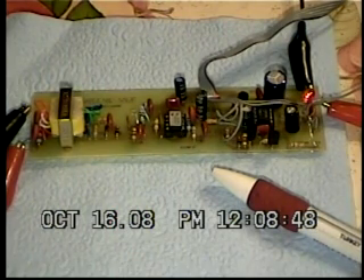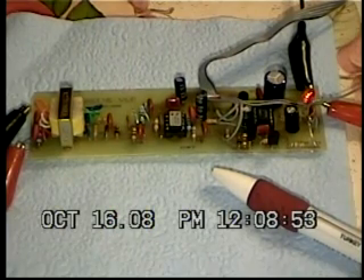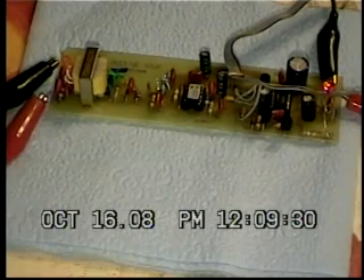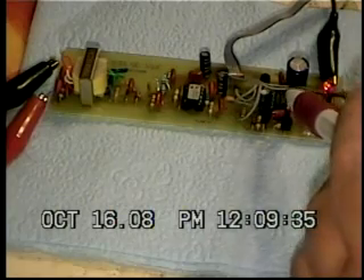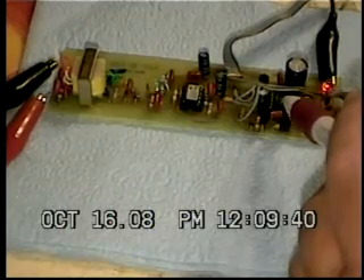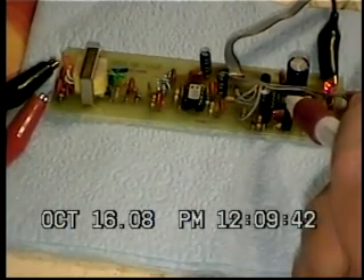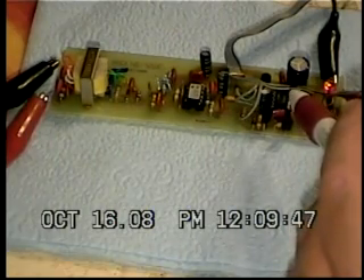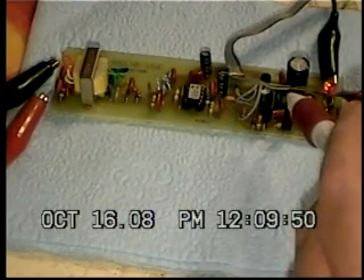For people who may want to extend the low end — like if they're out in open space — those capacitors can be made larger to bring the low end back in. Right here we have the LM386, and I use the N4 version, which is the best of the series. It will do almost a whole watt — typical is about 750 milliwatts, and they generally do that much or all the way up to about a watt.